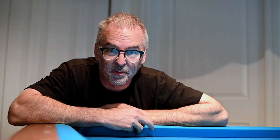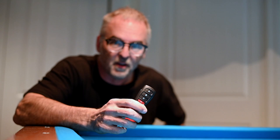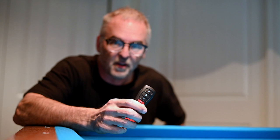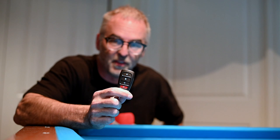Solution: a key fob. As long as I'm close enough to start my car, I can press the button and the radio frequency will go through my body, gyproc, stairs — whatever. After spending the day with the key fob trying to get it to work, I finally realized the problem: these key fob receivers don't come with antennas. So I had to make a little homemade antenna, and that solved the problem.